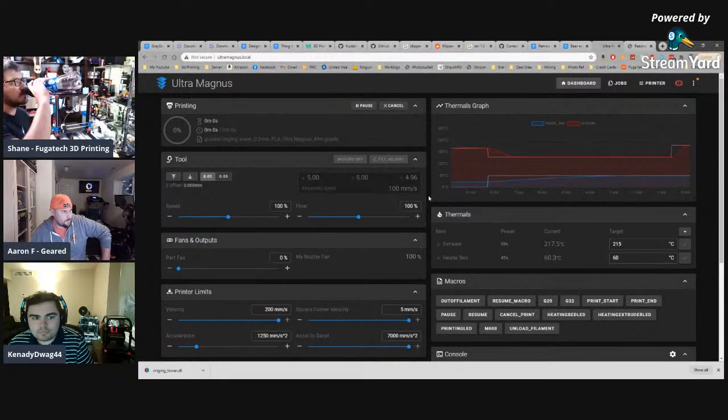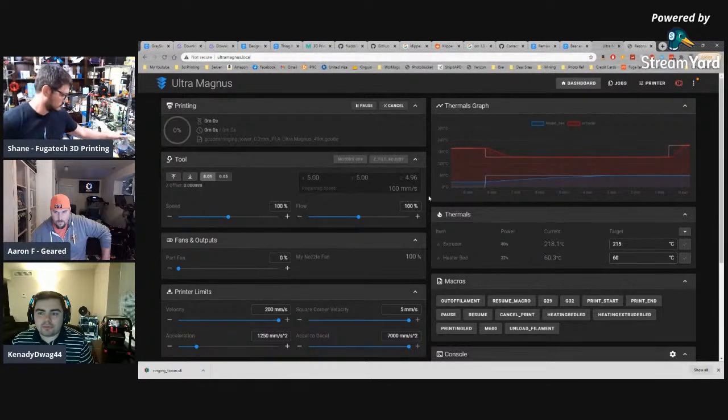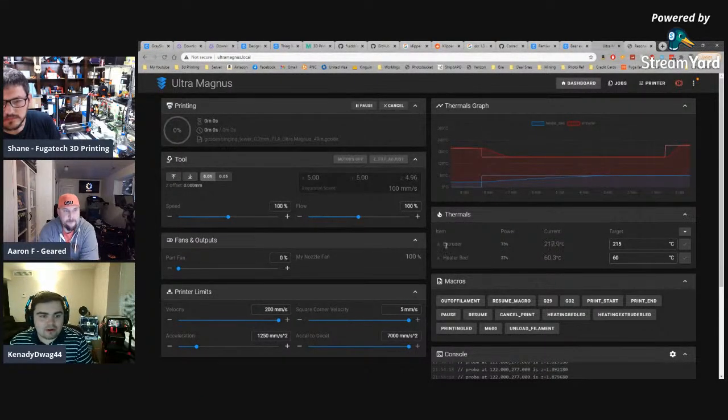That index is really just where you want Klipper to base your bed mesh off of. I've always just done it at the center of the bed because that's where typically there's a screw or something, at least on a Prusa bed. So you know that it's flat there and it's at the distance it should be at.